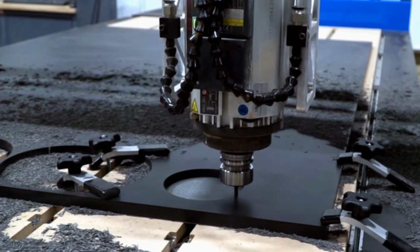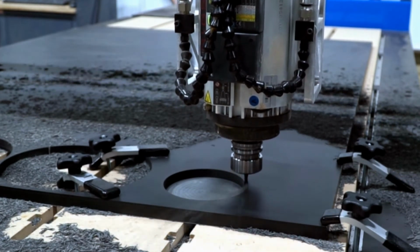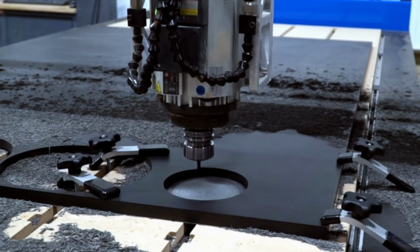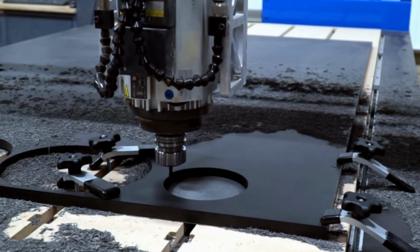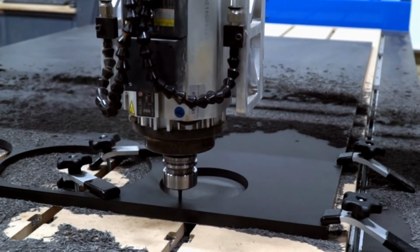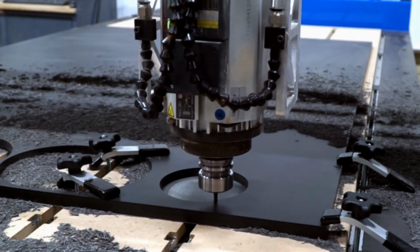Okay, so now you were talking about the CNC router also. Tell me some of the things you've done on there so far. I mean, what are your capabilities there? The CNC router, the bed size is 8 feet by 5 feet, so pretty much anything that fits in that window. It'll machine woods, plastics. We can do some aluminum on it. Just depends kind of on what the material is and how it's designed.